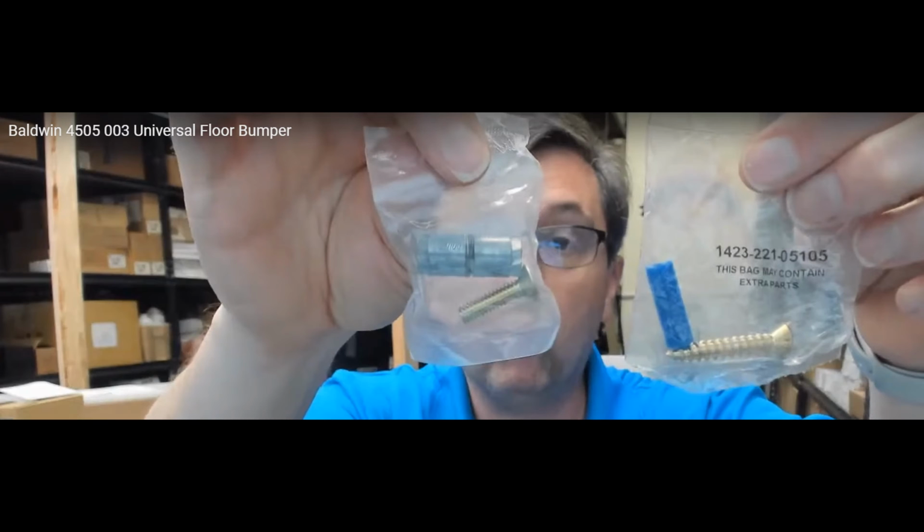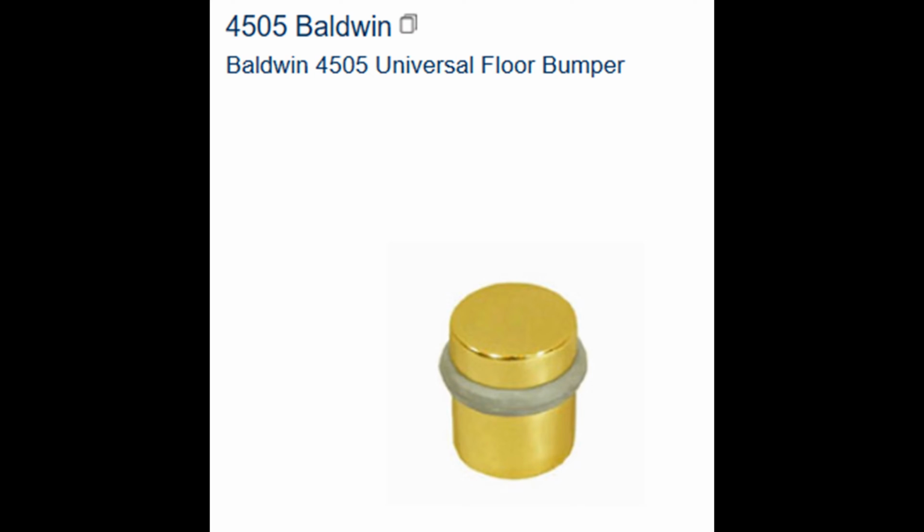The slide track idea is what would be called an overhead concealed stop. You mortise into the underside of the header, and you mortise into the top of the door. And then you mortise the face of the door slightly. The only thing I can relate it to is there are two components connected together in the center, and the arm slides in the track. So as the door opens, the length, when it's in the closed position, gets substantially longer. And depending on where you prep the door and the frame for it, that sets the degree of stop.